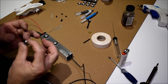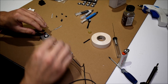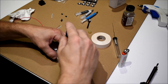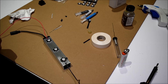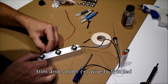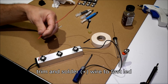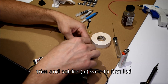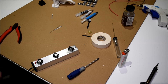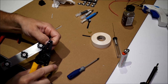Thermal epoxy is a permanent glue — you just stick them down, and at that point in the build you'd be done and just start wiring. For me, I like to have them removable in case I decide to use these LEDs for a different project — I can just remove them and clean the thermal grease off. Here I'm screwing everything down and making my first wiring connections: the positive wire from the driver goes into the positive side of the first LED, and the negative side of the driver goes into the negative of the last LED.